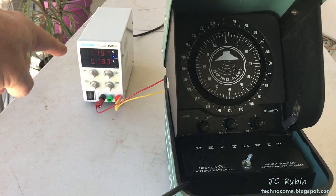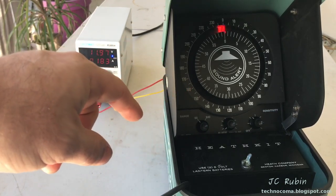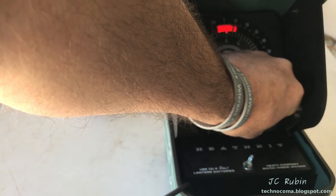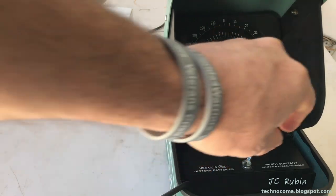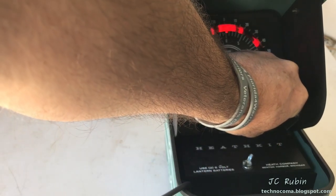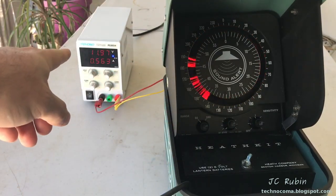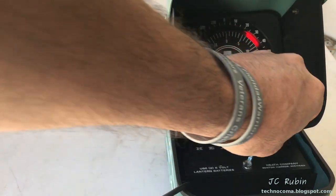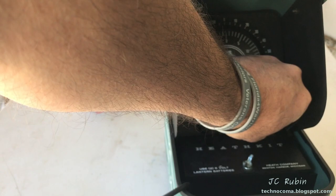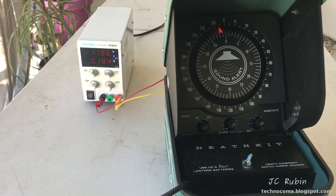I think it's a fault of the power supply and the amount of noise this thing generates when you crank up that sensitivity. I'll crank it up a little just so you can see — you can see it jumped up to 0.2 amps, and that would increase exponentially. It's at 0.5 — I don't want to go any higher than that because it will trip the GFCI again. So I'm going to lower this back down to an acceptable level. I think we're good right there. We're going to get started with some tests.